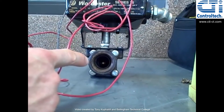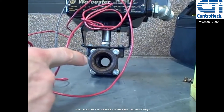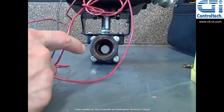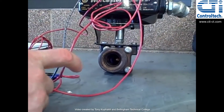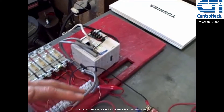I can go open — you have to watch it slowly rotate. So we have a full through ball valve as you can see. I can go fully closed and the electric motor winds it closed. We happen to be using a small PLC at this moment in time to drive outputs to drive the valve open and close.